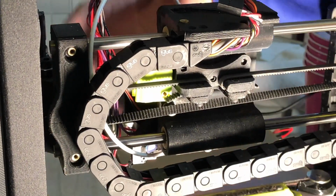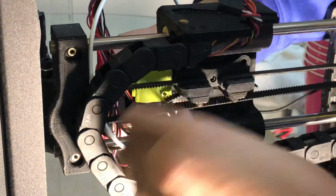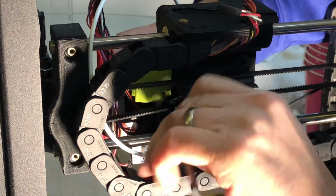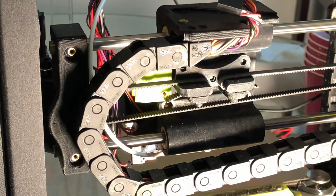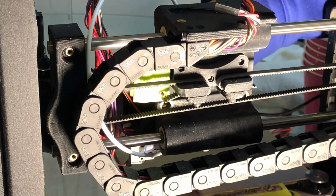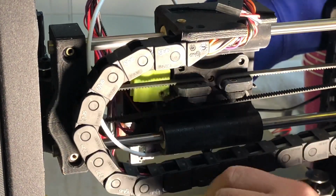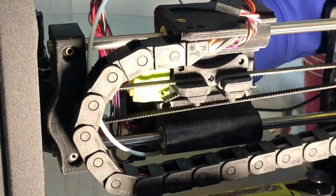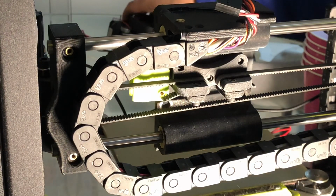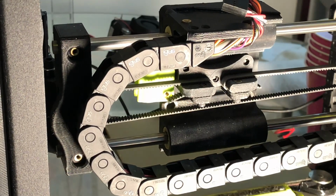Removing the bolts, remember to support the tool head in the back. So remove the 3 socket head cap screws. Put them in a cup labeled tool head so we know that these all go together. We've got one more in the bottom here, so 3 holding the tool head on. It's coming loose, so make sure you support the tool head. There should be a socket head and a washer. The tool head comes off, put that to the side. All right, on to step 2.